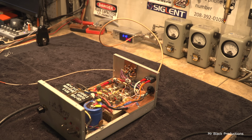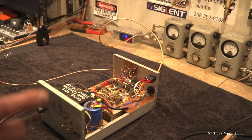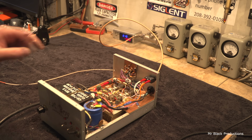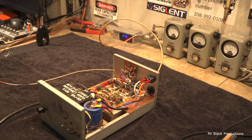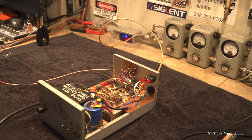It comes from the radio through the amplifier and out to the antenna, but then the RF has to come back down from the antenna through the box to the radio. And if you don't have almost a seamless impedance bump at this particular junction, along with all other amplifiers or any other thing that you put in line, the RF won't want to come into the radio, so you cannot hear and it makes you deaf. Your head would be up your butt, ostrich with head in sand. Amplifier beyond, can't hear nobody 3 miles down the road.